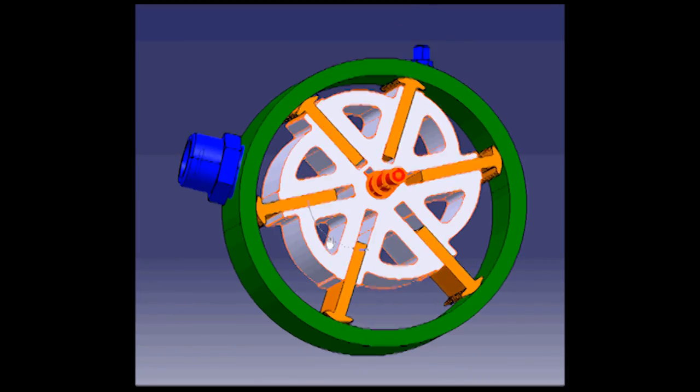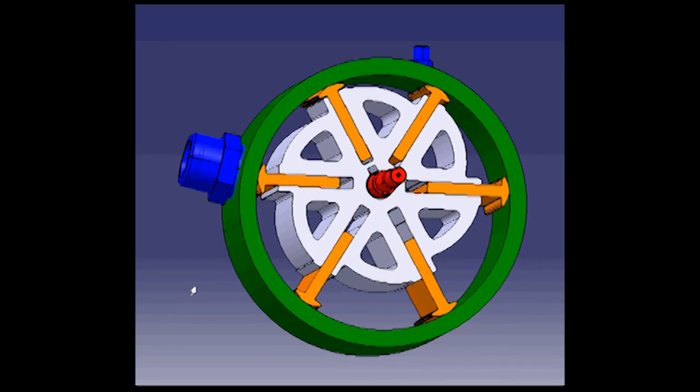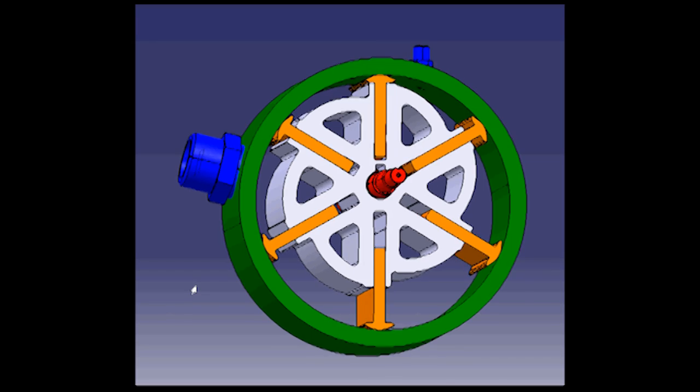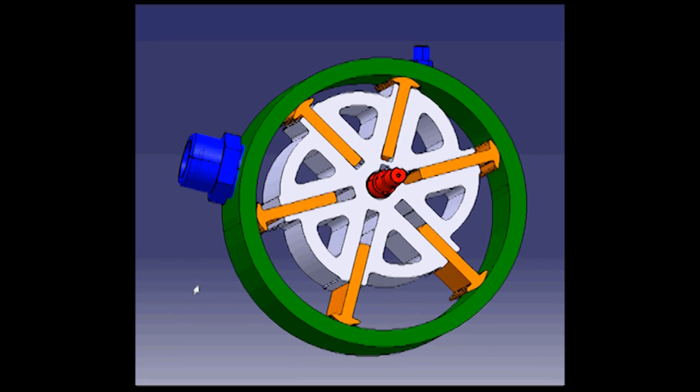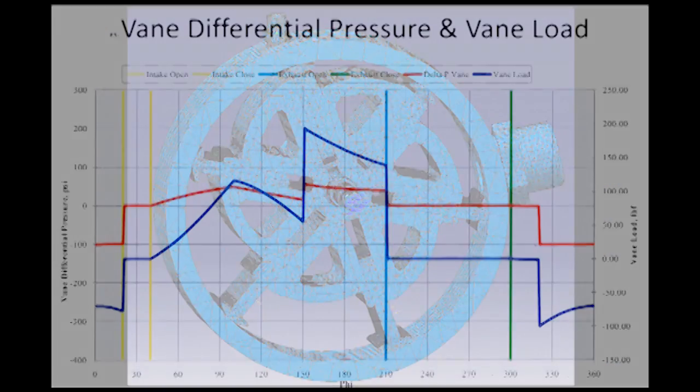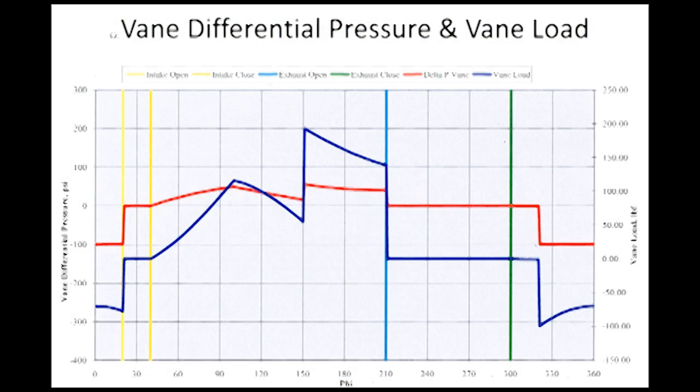Let me also add, as you're looking at this clip, at this photo, you're looking at the testing that we did on the Fibonacci rotary vane expander engine. And this shows a stress test of the engine. This graph also is another example from the result of hundreds of test runs testing the vane and torque power. At about 200 psi, you're looking at approximately 600 foot-pounds of torque.